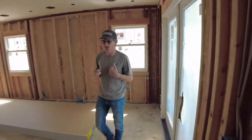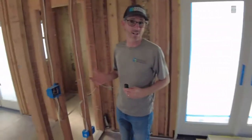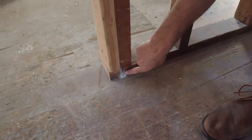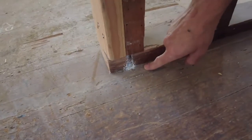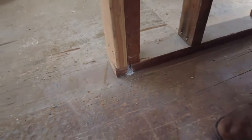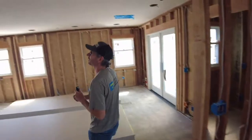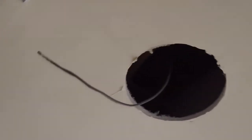We were happy with what we'd done with our caulking and foaming, but this is part of the reason we use the Aerobarrier — to get anything we missed. There's a good-sized hole right between these bottom plates that's been filled in, so there was certainly a hole through to the subfloor. You can see it looks different — it's white and a little flexible, just like an acrylic caulk, but the method it's applied is very different. We've also got the speakers and can lights up here where the Aerobarrier has filled in the small cracks — very hard to see, but we got up there with our flashlights and were able to identify that.